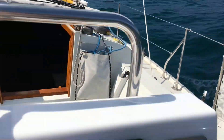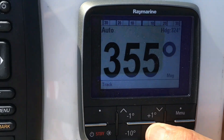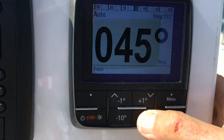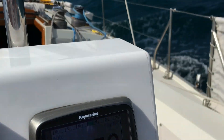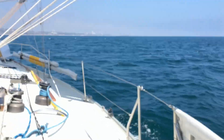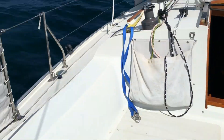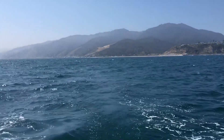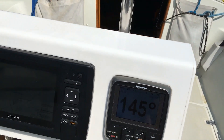So we don't go aground on the rocks here among Surfrider Beach, we can jibe just by pushing the buttons. It looks like about 130 degrees is necessary, so I'll just push the starboard 10 button 13 times. When you're sailing alone, this can be quite useful, especially if you're trying to hold an iPhone in one hand while jibing and keeping it focused on the instrument panel.